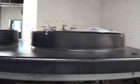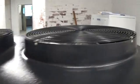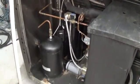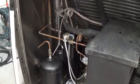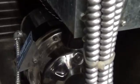So when you first power this up and bump the contactors, if your fans are rotating in the right direction, that doesn't mean anything, unless you have an HVAC technician there to confirm the compressor is going in the right direction. The right thing to do is make sure that your pump is going in the right direction. If the pump's going in the right direction, the compressor is.